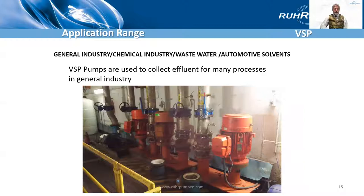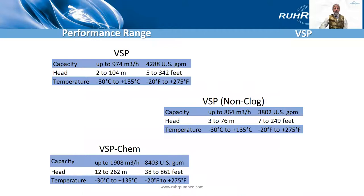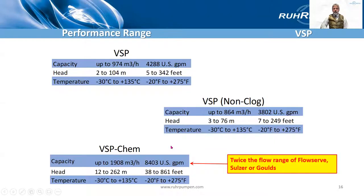Whereas the VSP Industrial typically sits above an open sump. Being installed in an open sump, the VSP has a square mounting plate for sitting on the deck frame. You'll note that the VSP Chem has flows up to 1900 cubic meters an hour, which is twice the capacity of the major competition.